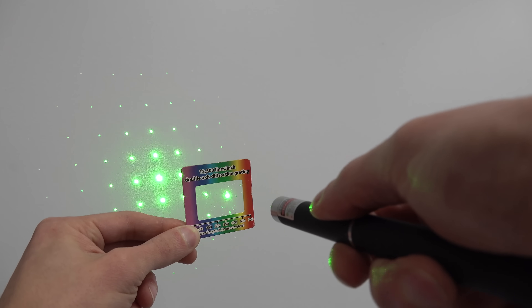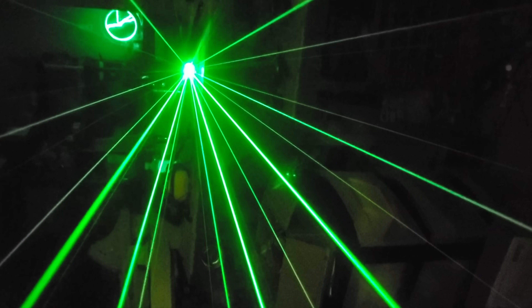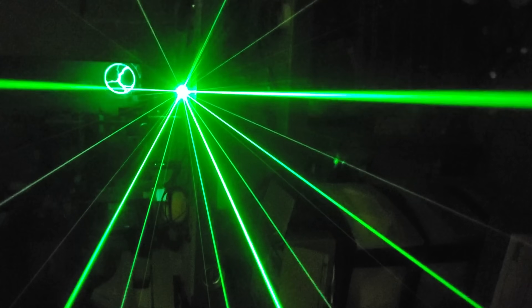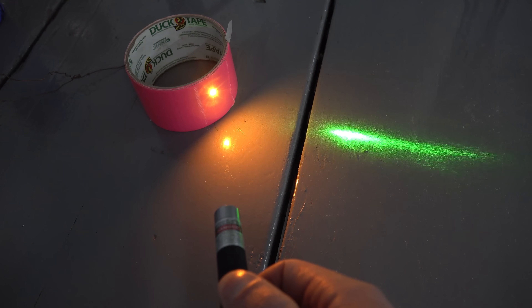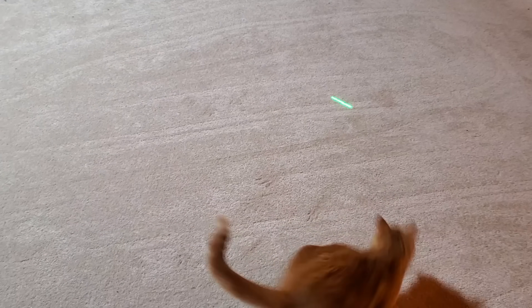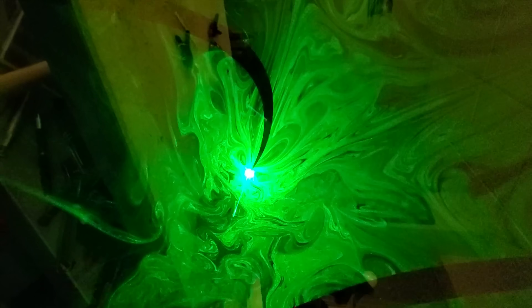This stems from the fact that they're driven by a powerful infrared laser diode that powers a separate laser crystal, and then the output of that is fed through a frequency doubling crystal to make green light. Super interesting physics, really, just done here in a sloppy way that makes them dangerous. I'm not going to spend this whole video talking about how these can burn your eyes out — I've already covered the topic in a few videos already — but these can burn your eyes out. Blinding risk aside, these laser pointers can be a great educational tool, and my first green laser pointer changed my life. As a testament to these dangerous little devices that have sparked curiosity in so many, I want to make a ridiculously huge version of one of these. It may not be the smartest thing I've ever done, but it should be really, really cool.